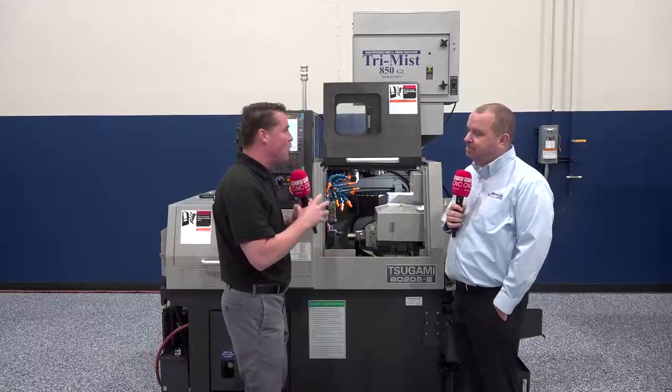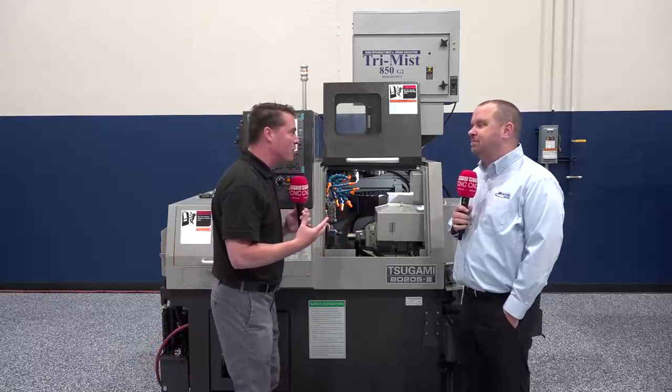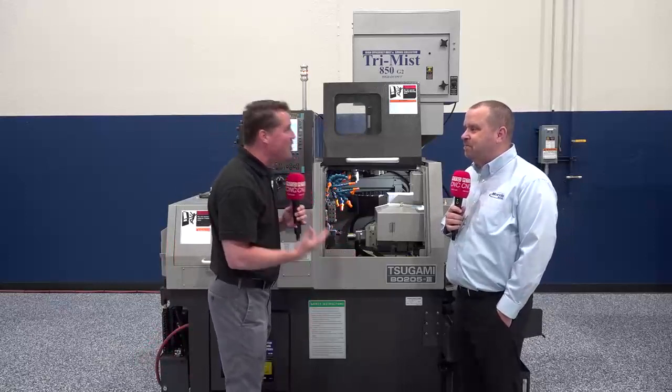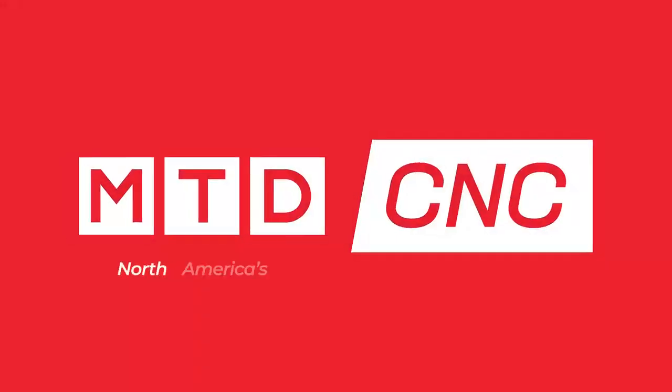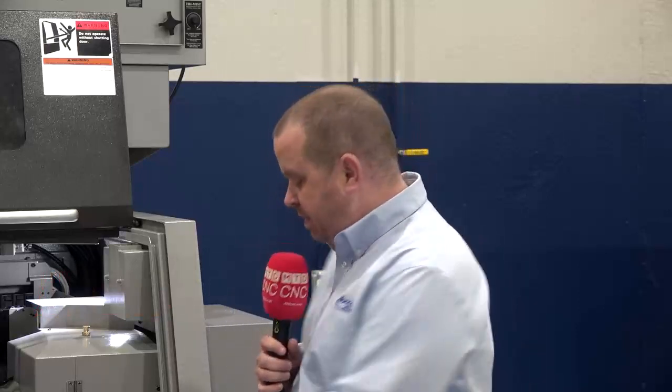Let's talk about Tsugami as an overview — what can I use it for, where can I use it, why can I use it, how can I use it, when would a customer look at Tsugami? The Tsugami platform comes into play when you have very high production parts, especially for the Swiss line. These machines are highly accurate, they're heavy machines, and you can do really aggressive depth of cuts. Multitasking is standard, and you always have live tooling capabilities. Options come into play with sub-side machining — if your sub-side has no live tooling needs, you can buy a 5-axis platform just to complete the machining on the sub-side.